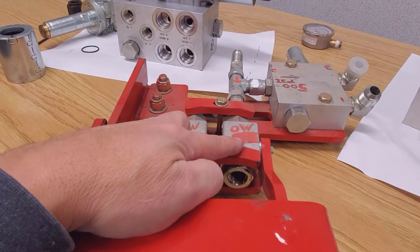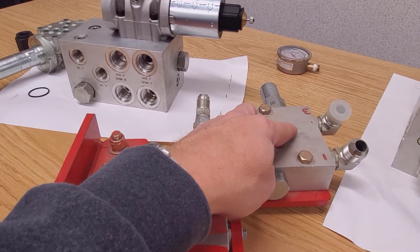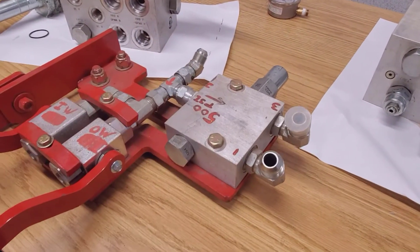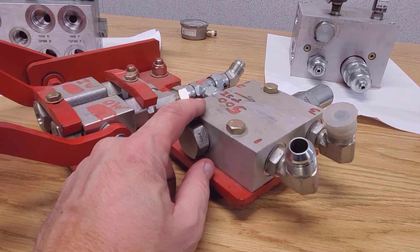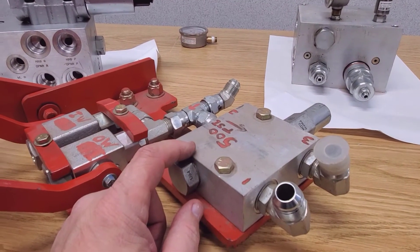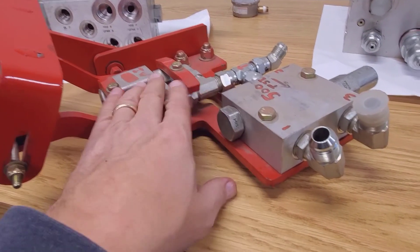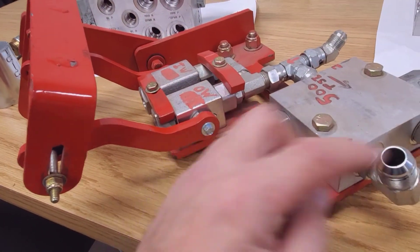The outer wing is fully extended and deadheading, so the oil coming in is forced through the pressure reduction valve. This pressure reducing valve is adjusted at roughly 500 psi — when it's cold oil it may be a little higher — and then it sends the oil out to the inner wing cylinder. There is a check valve in here so that when we're raising the wing lift up, it bypasses the pressure reduction and allows full system pressure to go to the rod end of the cylinders. There's no risk of bending cylinders when retracting — we have full system pressure and all the sequencing setup is bypassed.